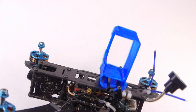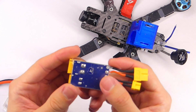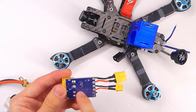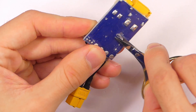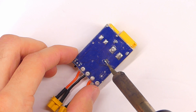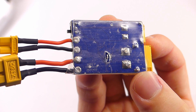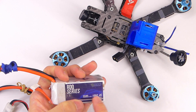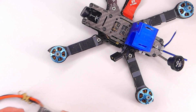There are pads on the back of the board — if you short the S and N pads, you get a little more time before the board decides to shut off the power. I tried both of those pads and haven't noticed any difference as far as being able to spin up the motors with a four-cell battery. It still doesn't spin up at all with four cells but still works with three cells, so I'm not sure what's up with that.